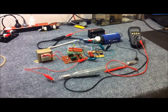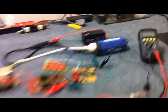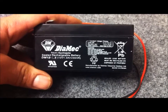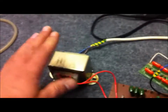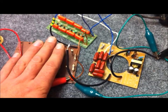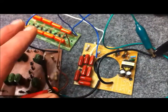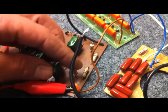Last but not least is my new modified Cockroft-Walton voltage multiplier circuit. I'll quickly show you the circuit and then we'll turn it on. Starting from over here — we'll run it from a 1.3 amp-hour 12-volt battery drawing less than 390 milliamps initial current. That goes straight into this inverter, converting it into 240 volts AC at 50 hertz, then into this transformer, then flowing into the multiplier circuitry. It's essentially three multipliers from three separate bug zappers. I've made some modifications — I've taken these resistors and just chopped them off, so they're not connected anymore.